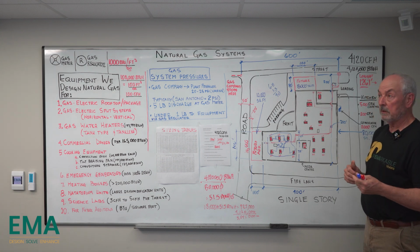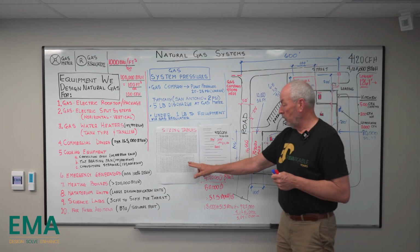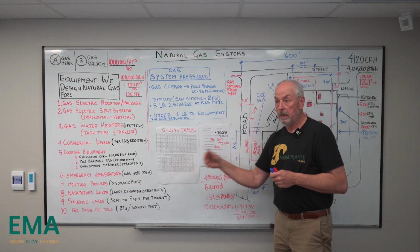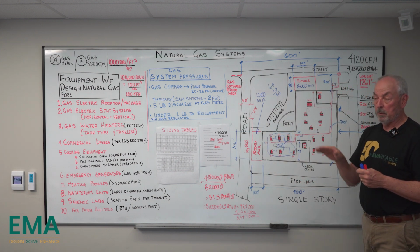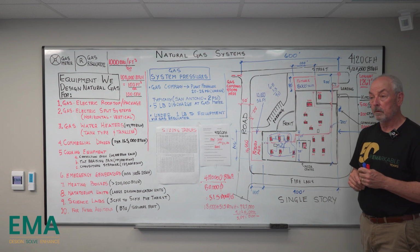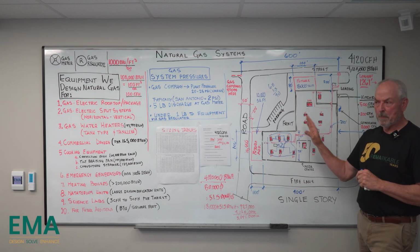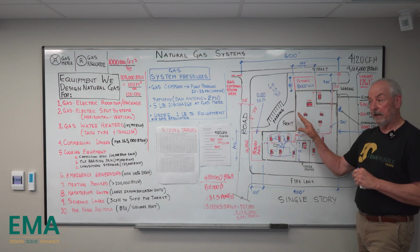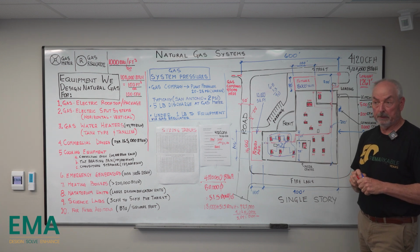I mean, we've looked at that on projects where we come up with a 6-inch line based on this conservative table, and compared it to the 3.5 PSI drop table, and we're able to drop the line size maybe from a 6 to a 4 on big high schools like Highland Park High School. I'm hoping this is enough to where we can sit down and actually do a roof plan or a gas plan, and then it makes sense.